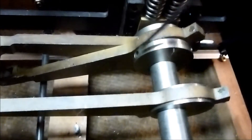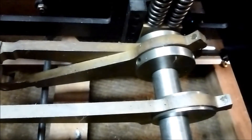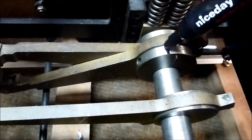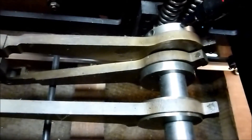There are two grub screws in these eccentrics and the throw of the eccentric is the center line between the two, so it's a good idea to put a little felt pen mark right on the highest point so you know what you're setting for. Move the other one round and do the same on the forward one.